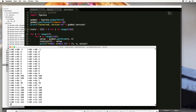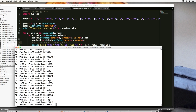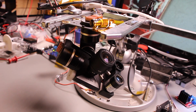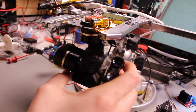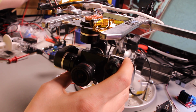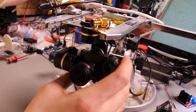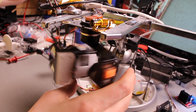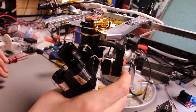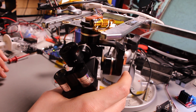I mean, I think we should probably just try splatting these all on and then saving them while the gimbal control loop is off. I think that worked. I'm just going to power cycle the gimbal and hold it and see if it starts acting normally or if it starts thrashing itself. Huh. It was slowly thrashing itself, which is different.